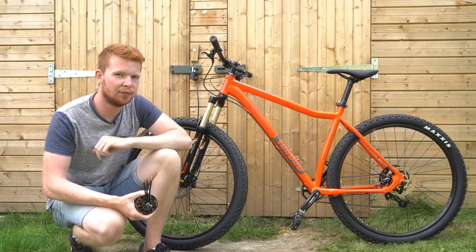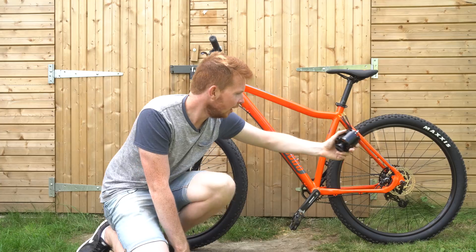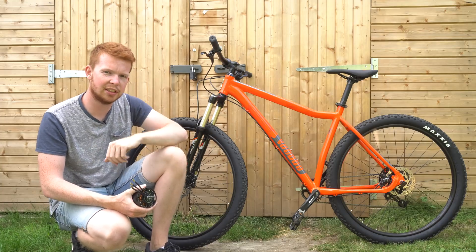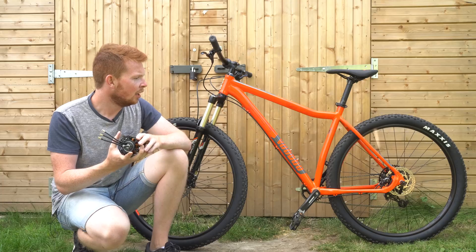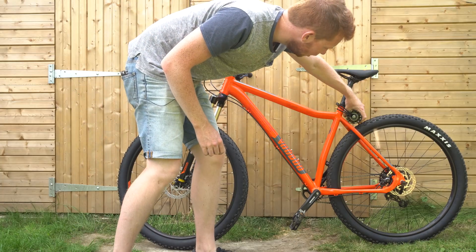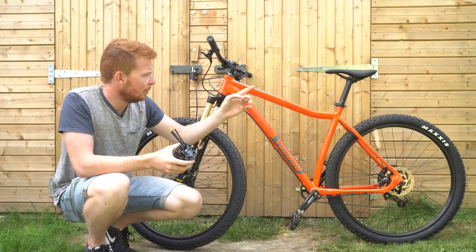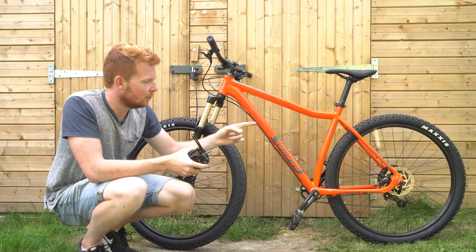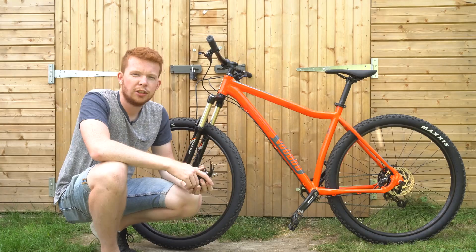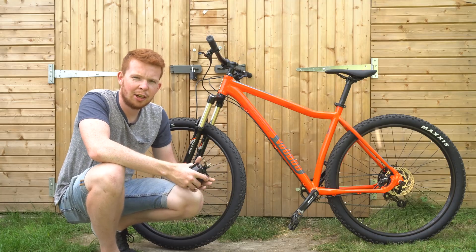On the version 3 electric bike I mounted the motor on the side of the rear fork, which worked pretty well but was simple. The only issue was that with it hanging outside you could only lean the bike down on one side. Now with this bike, because it has a disc brake instead of a V-brake, I can mount the motor behind the seat post and in front of the wheel. The only issue I need to overcome is getting the pulley onto the wheel without interfering with the disc brake and caliper. So I'm going to model the rear part of this bike in Fusion 360 and design a mount for this motor.